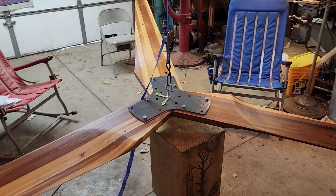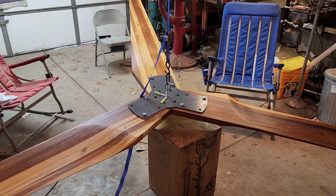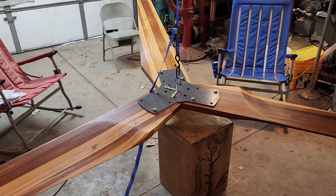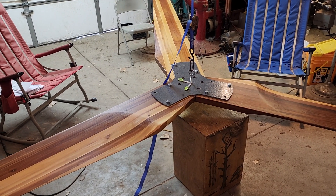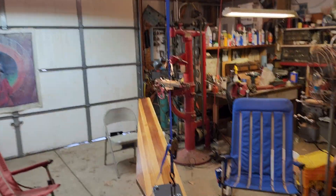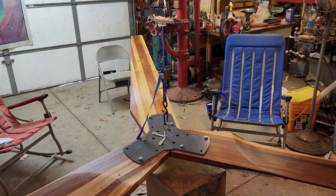As long as the machine starts up in low wind and we have a pretty good pitch for most of the blade, the inner part's job is really to not provide too much drag and to hold the tips on. These machines do start up in very low wind — they spin no problem at a couple miles per hour. Anyhow, to balance the blade, sometimes we'll spin balance on the tower, but here I have it hanging.